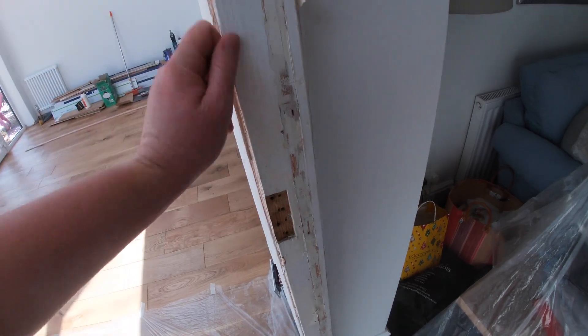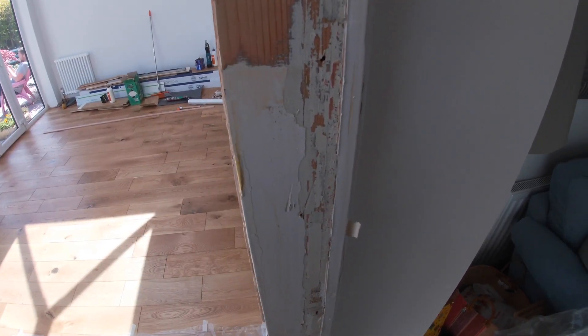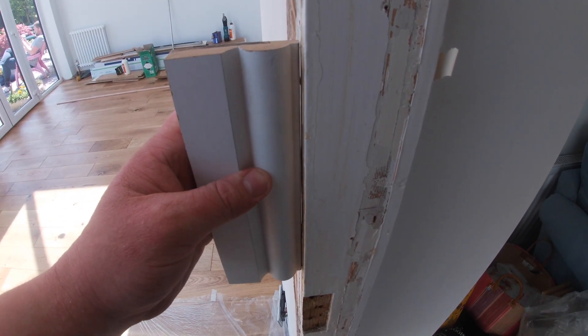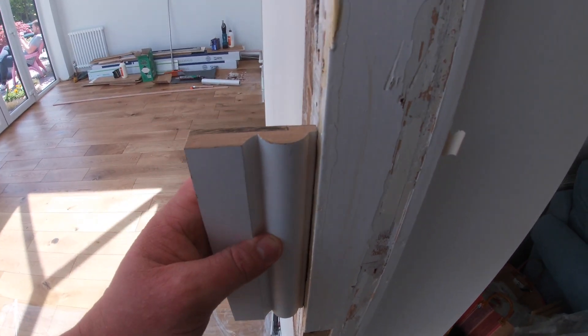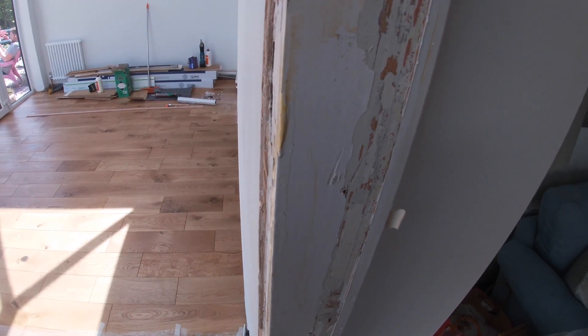You can see it's got all the paint. The issue is when you've got paint and you're trying to put new timber, new mouldings, onto something existing that's got loads of paint, then it doesn't really join correctly — it looks a bit nasty, not very neat. The aim of second fix is you want to be as neat as you can, because it's seen at the end of the day. It needs to look really neat and nice.